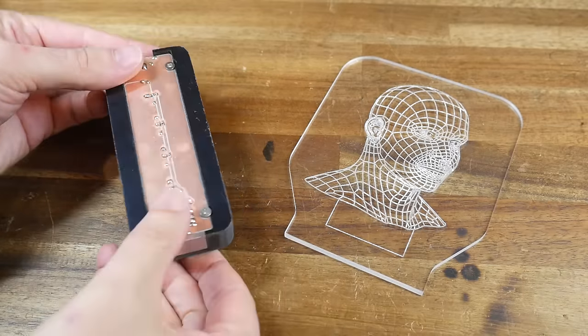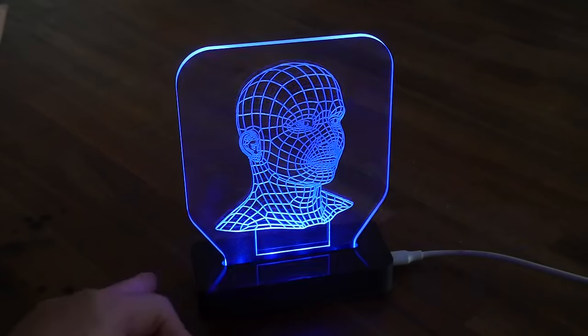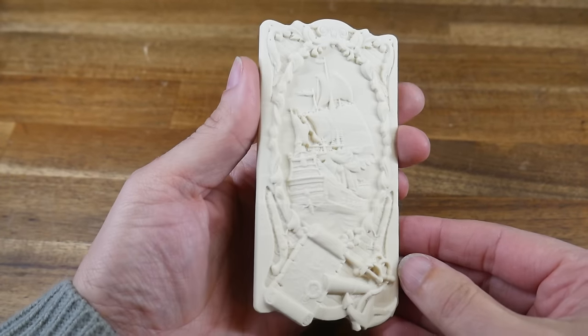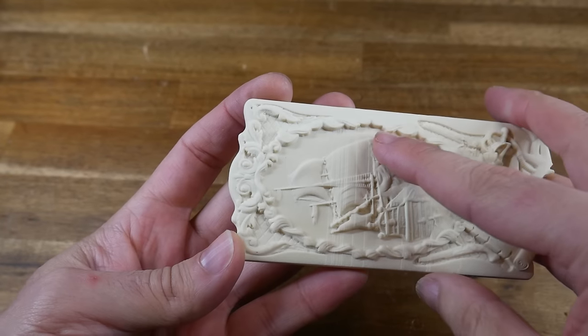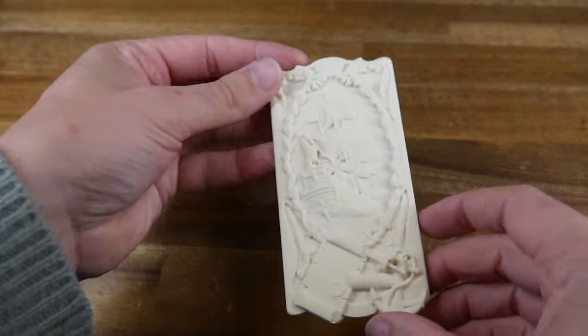So far from the examples, we've made the four components that make up the LED lamp, and there's G-code provided for four different acrylic patterns. This is a nice project that shows off the machine well. We've also machined this 3D relief out of model board, and it comes out with exquisite detail, although I don't think I bolted this one down properly, as we can see the Z-height is gradually changing over the job.